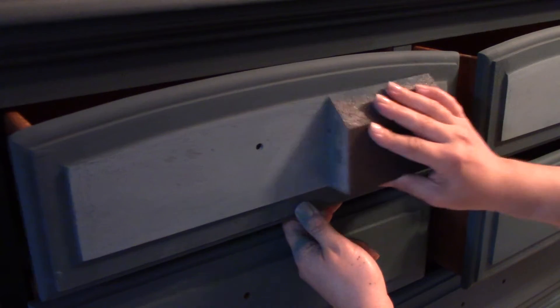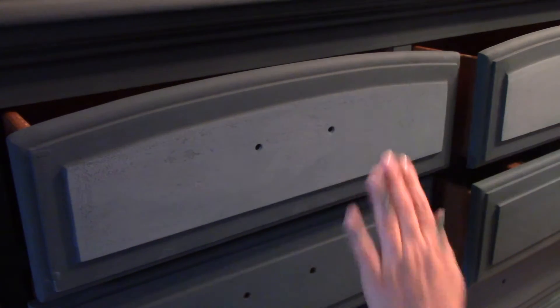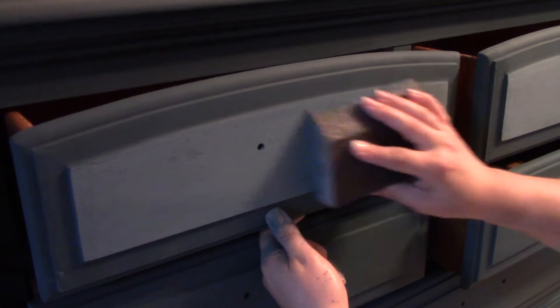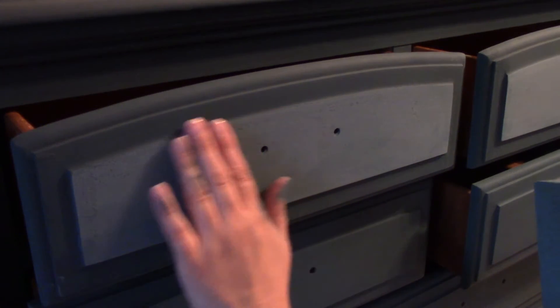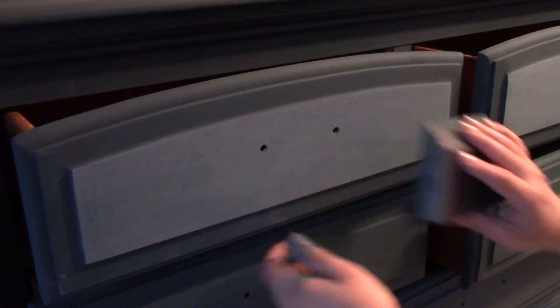I went all over any areas where there was that raised texture on the drawer fronts and a little bit on some of the tops of the pieces. This only happened when I was down to the bottom of the section of the paint. Once I added a little bit of water and stirred that up, it glided just fine, and that's what I ultimately ended up covering it with. I used the fine sanding sponge to take it back to the point where it was nice and smooth, and then I was able to apply a third coat after that. Sanding everything created a lot of dust, so I went over everything with a wet cloth gently — because we haven't sealed it yet and we haven't done any wax — then followed everything up with a tack cloth once it dried.